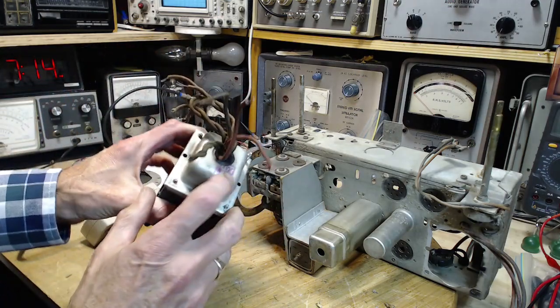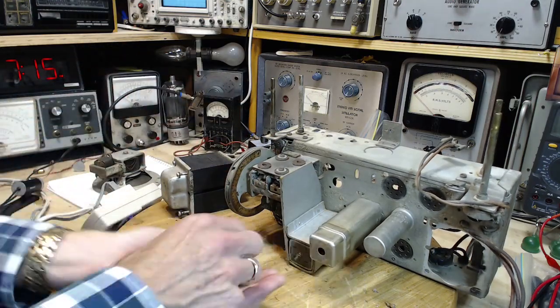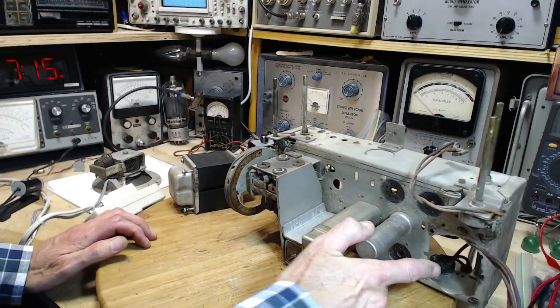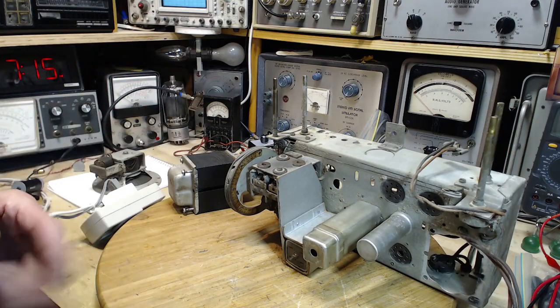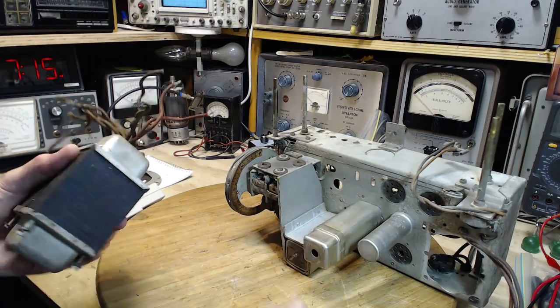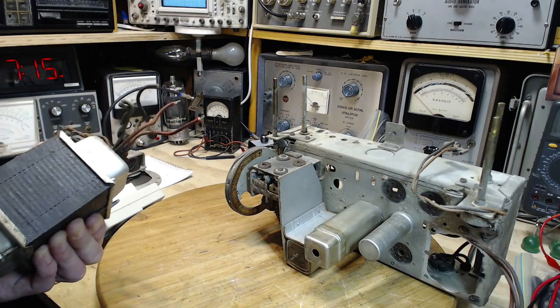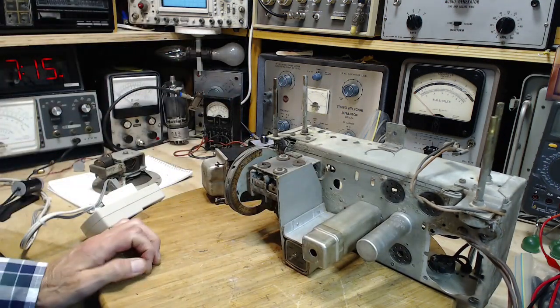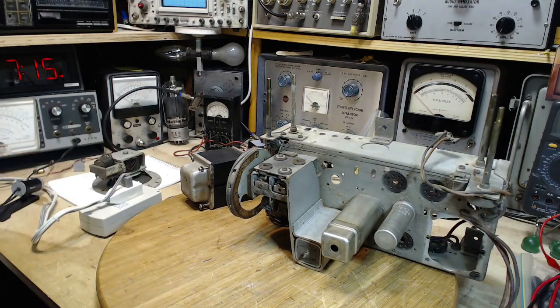Any other hints on here? Why would this fail? Who knows the exact reason — wear and tear, probably the only way to put it. So what am I going to do? No question — we're going to try to find a transformer I can stick in here. That's going to supply 5 volts for the rectifier, 6.3 volts with a couple of amps to heat all these tubes. And this thing resolves through the power supply into 230 volts DC — double 230 gives you basically 500, maybe 500 to 600 volts center tap. That should be enough to make this radio operate again. That's really all I can do now until I obtain the transformer. Thanks for watching.